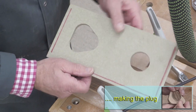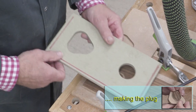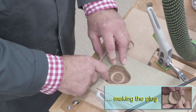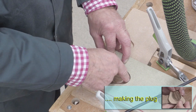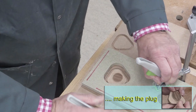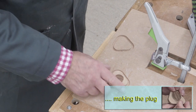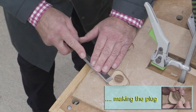Now I'm going to turn the template over — I've still got this reference edge here and the other edge as the reference at this end. What I've got to do is cut away at the same depth as before, clearing all the material there prior to doing a cut all the way through following the template. And there it is. I remove my template — this is the piece I want. You can see where it needs just a little bit of cleaning up, and I can do that now very simply.